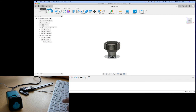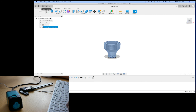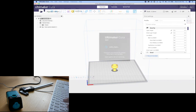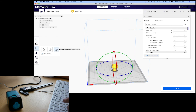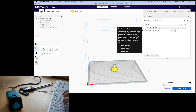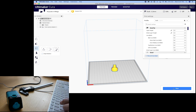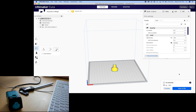Next I'll hit 3D print and send that to Cura. I'm going to rotate this onto that face and slice it up. I'm going to spiral the outer contour because I think that helps it print better when it's got threading on the outside. I'll set infill to 100% for this — I want it to be very sturdy. That looks pretty good, so I'm just going to print this and see how it goes.